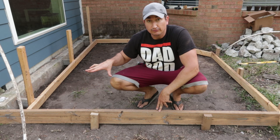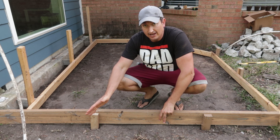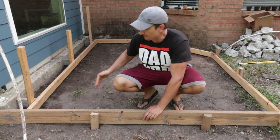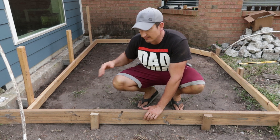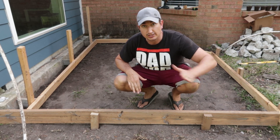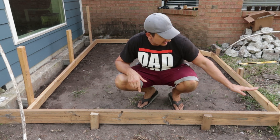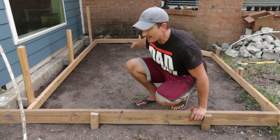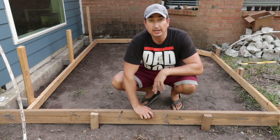I've got the whole perimeter form in place now. The takeaway is I wanted as flat a surface as possible, but I wanted it to shed water away from the house, and also shed water a little to the side as well. I have to leave some space between the new pad and the house — one primary reason is to allow treatment for termites every few years. If water rushes down into that space, it could channel soil out of there, so I added a little bit of pitch this way too. I got the level mark off the line, then drew a mark about an inch less than that, and that gives me just a little bit of pitch. I boxed off the rest in the back using a level board.